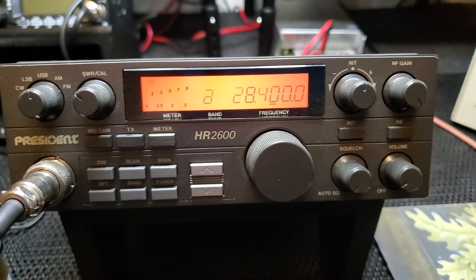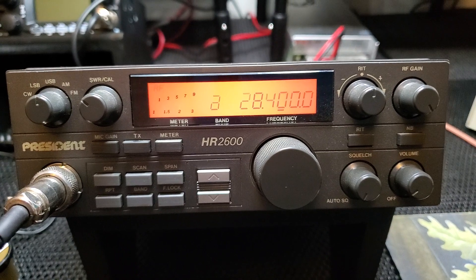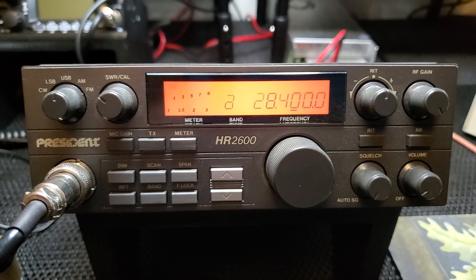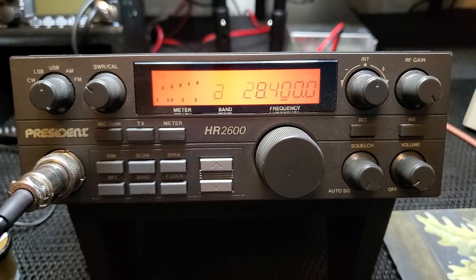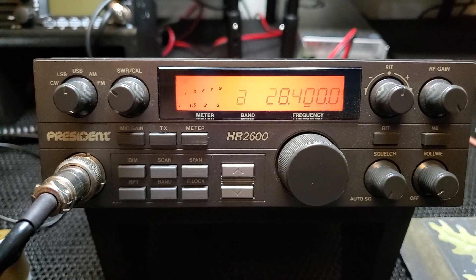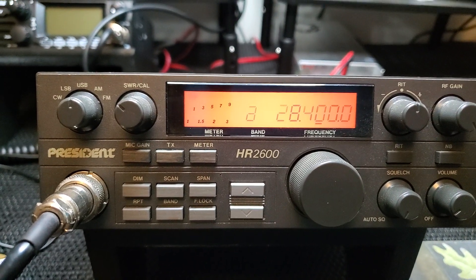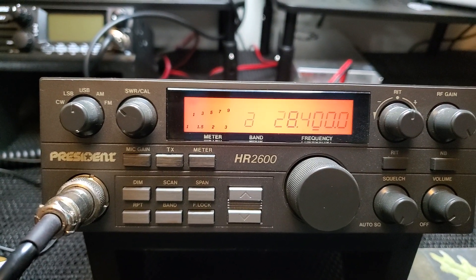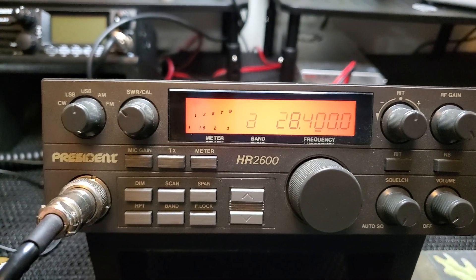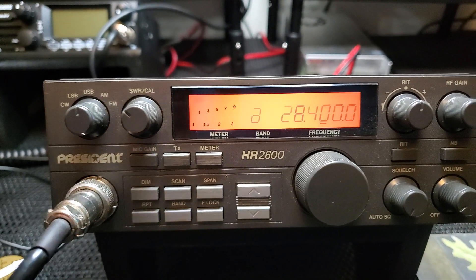You really don't need to worry about lower sideband on a radio like this because you wouldn't use it anyway — everything is upper sideband when you're on 10 meters. You could realign it just for the sake of argument, but nobody's going to use lower sideband on this radio. I think on the HTX-100 it doesn't even have lower sideband — I believe it just has FM, CW, and upper sideband. Maybe it has AM; I'm not exactly sure, I'm not as familiar with that radio.